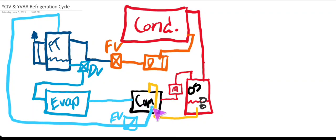The economizer valve labeled EV pulls the vapor gas off the top of the flash tank through a line back into the suction side of the compressor, coming in close to the discharge end. Remember: the back half of the compressor is the motor, and the front section is the actual compressor screws. A liquid level sensor monitors how much refrigerant is in the flash tank, trying to maintain a set range — typically mid-teens up to 30-40% depending on charge and load. At full charge and full load it usually maintains around 20-30%, with the feed valve at maybe 50-60% open.